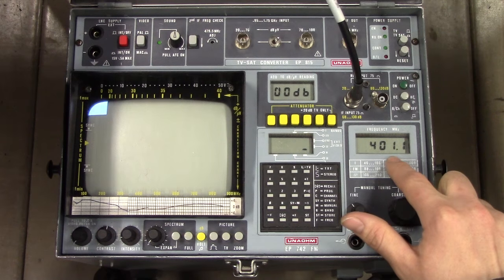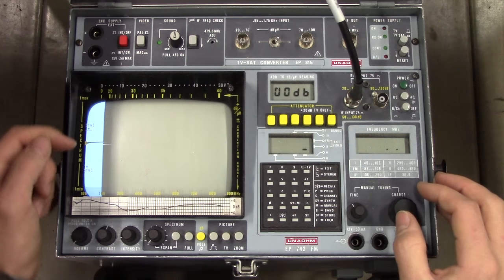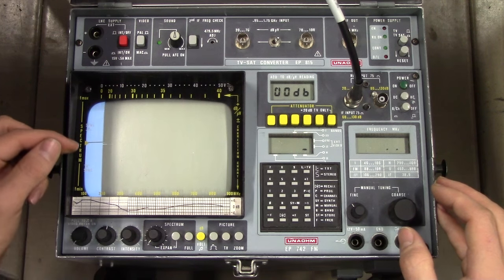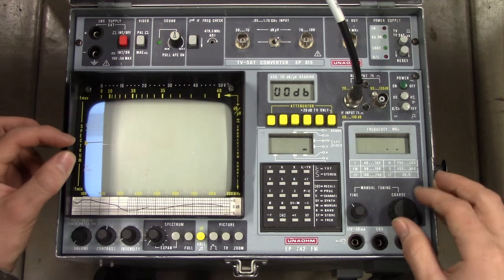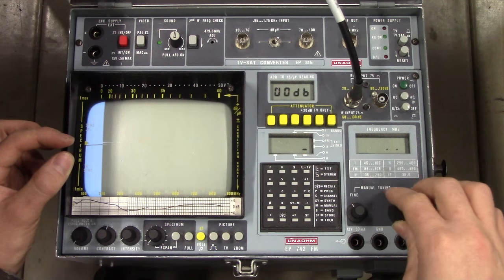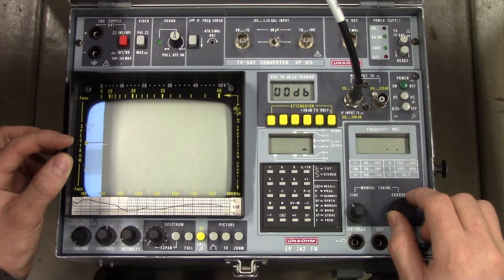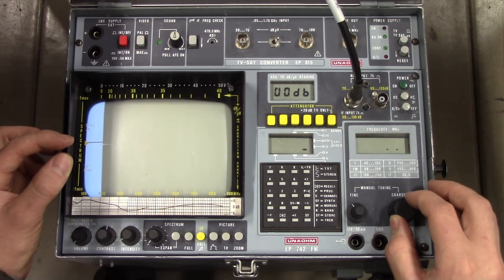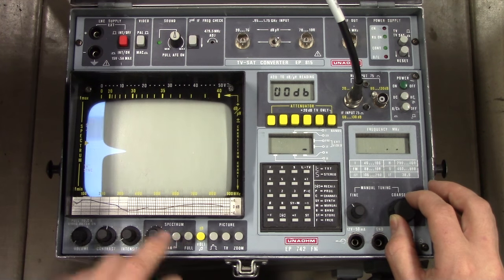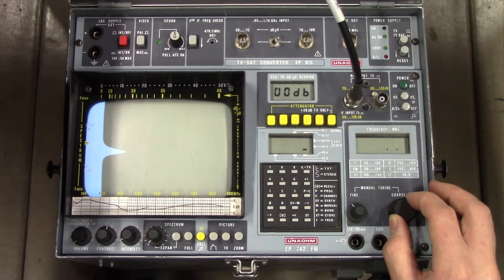This is the frequency display here, which turns into a little dark line on the CRT, which we can adjust using the 10-turn potentiometer and fine trim. It's a bit dodgy, this one. But we should have some signal going on. If we zoom right in there - yeah, that's a little peak. I might turn this level up.